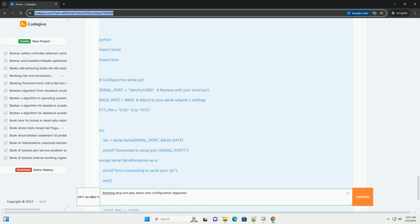DIGIPEAT 1 enables the digipeater function. DIGIPEAT path: extremely important, this sets the digipeater path. Do not use WIDE1-1 WIDE2-1 unless you fully understand the implications. Using a path like this can easily cause loops and disrupt the APRS network. WIDE1-1 is generally safer, but still use it with caution. Consider only using paths for stations you hear regularly to limit loops. You can also set the max_age in direwolf.conf to limit the age of packets that you will digipeat.